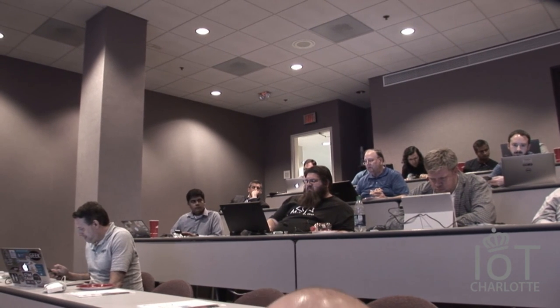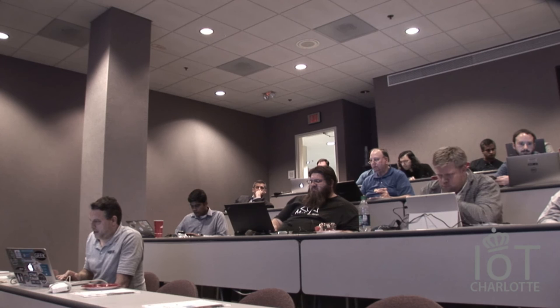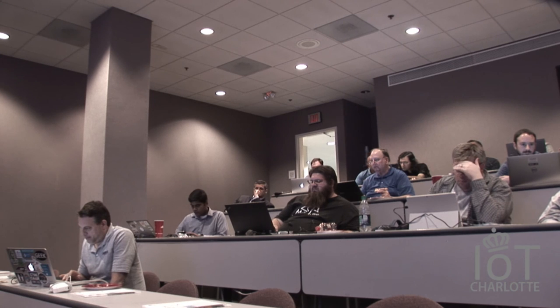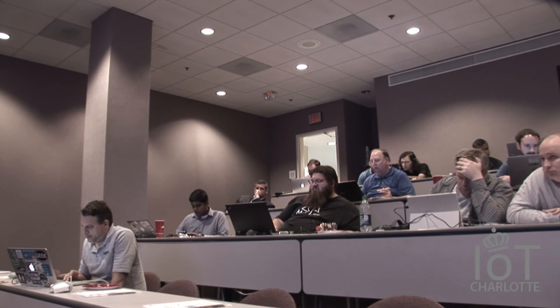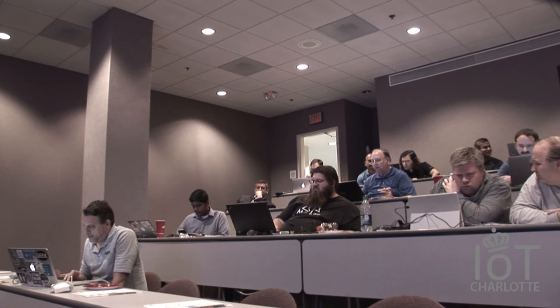It's really not as long as it should be. What does it take to get on that list? Because it looks like some big name players who are doing some really niche things got their really weird things on that list, and then other common things don't make it. It's got to go through the whole ratification process with the Bluetooth SIG, and they got to think it's necessary to include. Those attributes now get inside every stack that gets sent out, and unless you're selling 100 million, you probably won't. That's why there's some obscure ones, and things that were selling 100 million of whatever. But that's the SIG for you. That's not us.